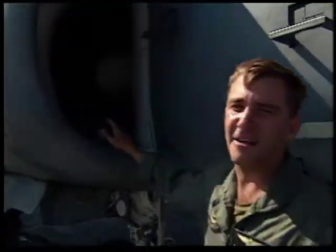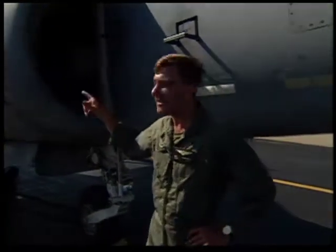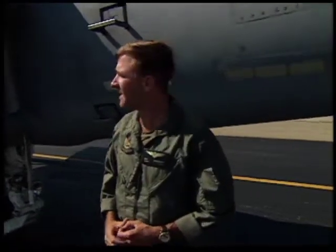Okay, first thing I'll point out is the engine in this aircraft. The aircraft is basically designed around the engine, since we transition from wing-borne to jet-borne flight, and when we're sitting stationary hovering, the only thing that's holding us up is our engine. So that's probably the most important piece of gear in the airplane. It's a Rolls-Royce design, 406, and it develops 23,000 pounds of thrust.